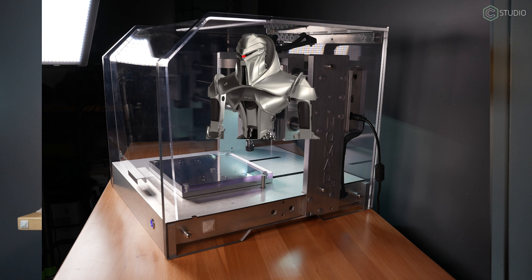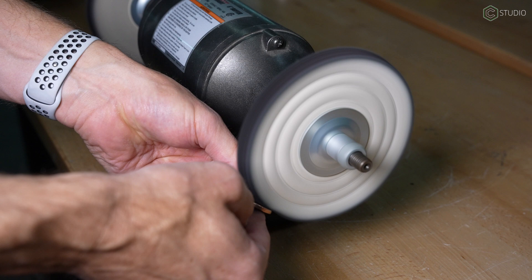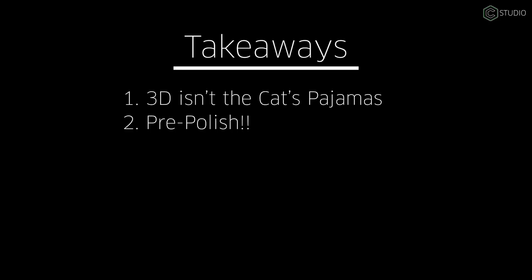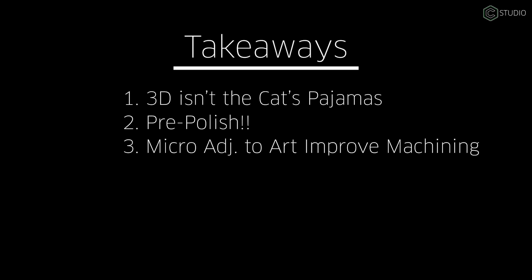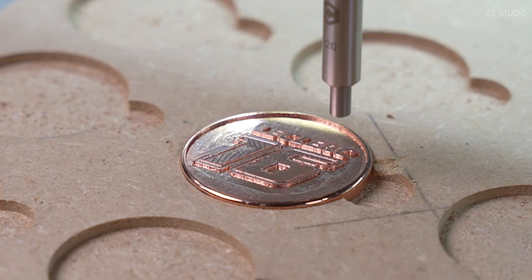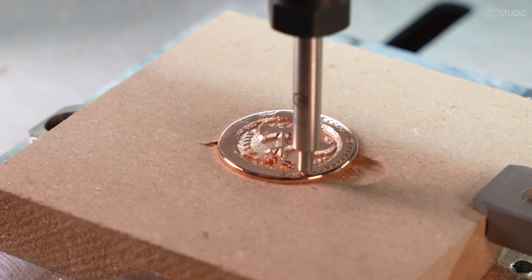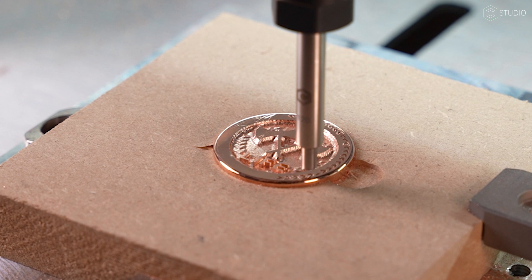What did I learn throughout this project? A number of things. One, you don't need 3D elements — there's so much to be done with simple toolpathing. Two, pre-polish your coins. It's a lot easier to get a nice fine polish on the coin without getting polishing compound into the tiny little sections of your design. When you've done that, you're already 90% of the way to a shiny design. Micro adjustments to your art can yield some pretty big benefits. Your design can be increasingly more interesting utilizing different cutters and different depths. The MC Etcher is an absolute artist with these projects — there is no other cutter that can add that level of detail that quickly. The Array tool excels in a coin format; making decorative borders was easy. Circular sign making is the natural progression from there with that same tool.